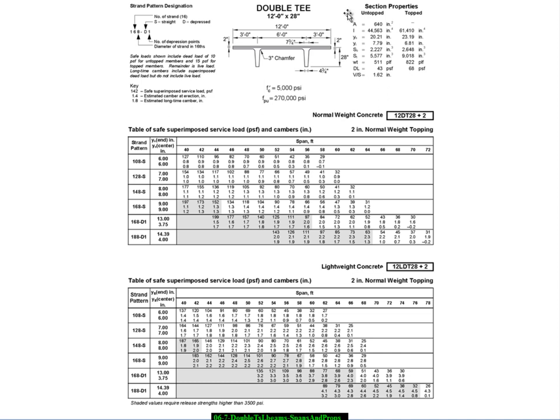The set of tables we're looking at right now happen to be 12 feet wide — from this edge to that edge. The ribs are set in 3 feet from the ends, so when these members are assembled side by side the spacing of the ribs is equal. In this case it would be 6 feet, which is half the width of the overall panel — so here is that 12-foot dimension and the 6 feet from centerline to centerline of the ribs.